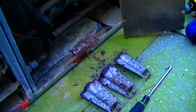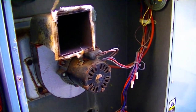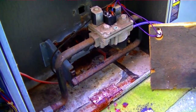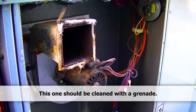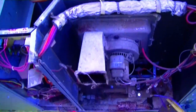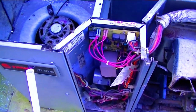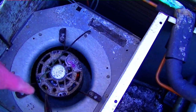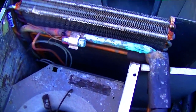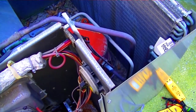After seeing the burners and the amount of debris in the tubes, plus the general smell and condition of everything, I'm going to take the top off and look at the heat exchanger for obvious problems. It definitely needs a good cleaning — I'm sure it's never been cleaned. With the heat exchanger now exposed, we can see the gas controls, integrated furnace board, blower, evaporator, and Trane compressor. Let's take a look at the heat exchanger.